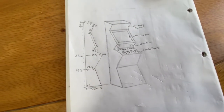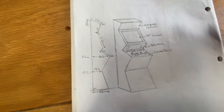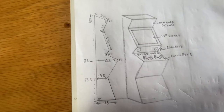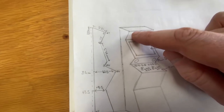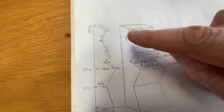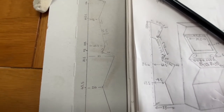What I've done now is a kind of side view. I've made it slightly less deep because I don't want it protruding into the room too much. I've measured my rough drawing and scaled it to be around about 180 centimetres in height, and I've roughly worked out the dimensions of each point. These looked a bit like right angles, so I made them right angles because they're a lot easier to join together. The back will be open and attached to the wall.